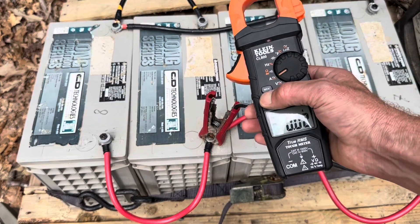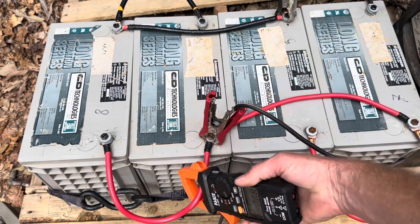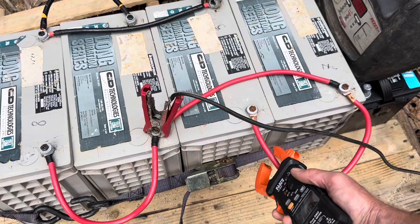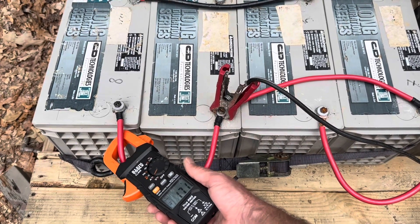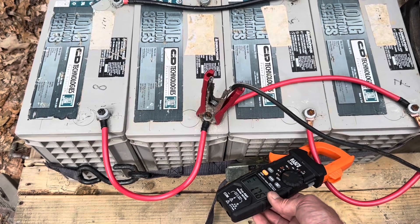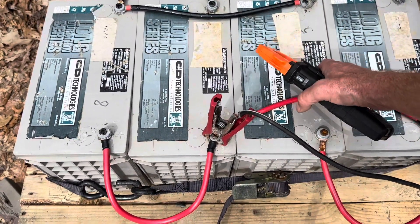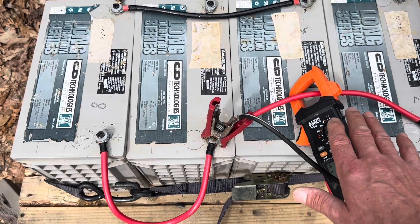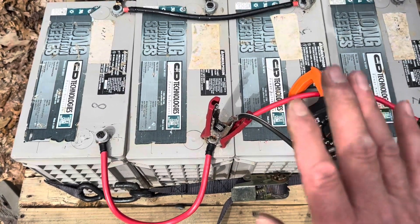Let me zero the amp clamp. We should be around 8 amps coming out of the charger. The battery on one end is receiving 2 amps. The other end: 1.78 amps. Checking again: 1.74 amps - we're within 0.01 to 0.02 of an amp between the packs, instead of a big difference of two to four amps per pack. Half the charger's output is going to this pack and half to that pack. Each battery is staying perfectly balanced - and it works the same for discharging.